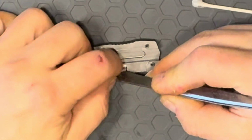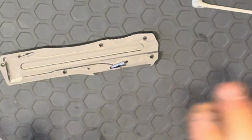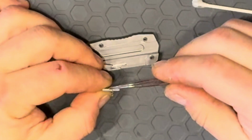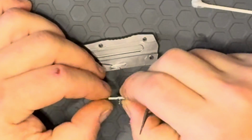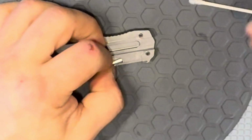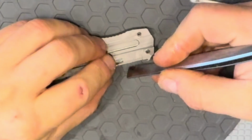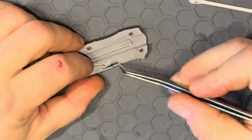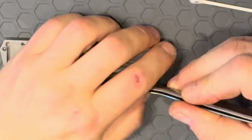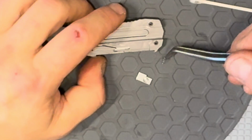What's making installing the front lock gate plate more difficult than the rear one is the fact that the frame steps down that little fence that kept the spring in. On the other side, it's partially cut off to allow for the firing lever to fit in. So that little corner here catches the spring just so that it starts bending, and I really can't stress it enough.